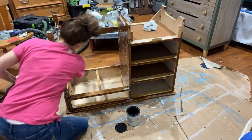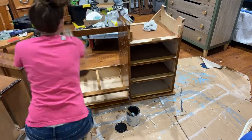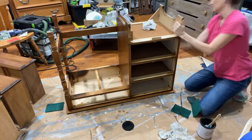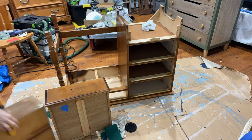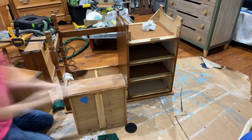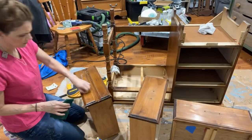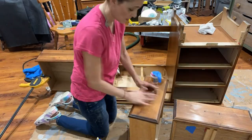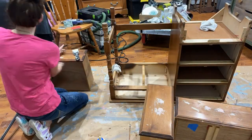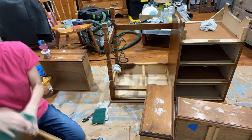As I let repairs sit and dry, I got to scrubbing down this piece on the full body — inside, outside — making sure that the surface would be ready and prepped for paint. I'm really scrubbing it down, using my scrubby pad and my Heirloom Traditions deglosser, then drying it off with a towel, and filling those holes for new hardware.